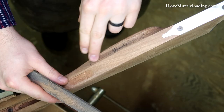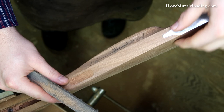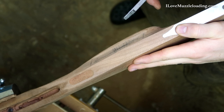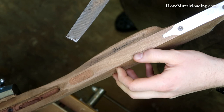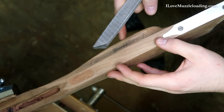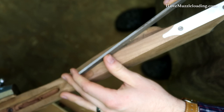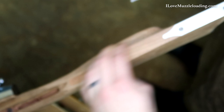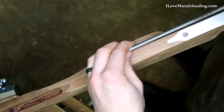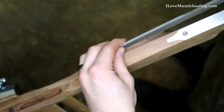Now I'm going to come in here where we marked under our cheek piece there, because you can see from the top down, you can see this bulge here. And we want this whole face to be very even as it goes through — we don't have near the bulge on our left hand side as we do on our right. So what I'm going to do is bring in just this flat file here and clean it out so it's a little more effective. And if you're worried about your cheek piece here, you can use a safe-sided file and run your safe side up against that. I'm not too concerned about that right at the moment. I'm just going to come in here with this file and run across, trying to establish and get rid of that bulge there. It might be better really to come in there with a half round.